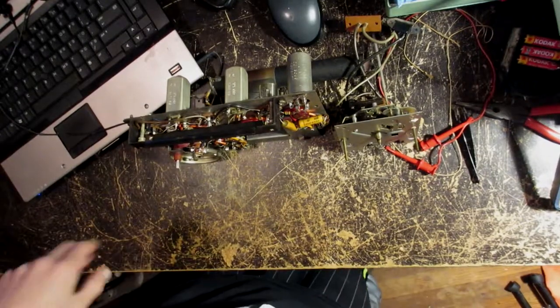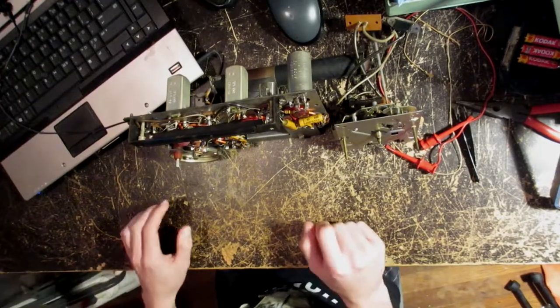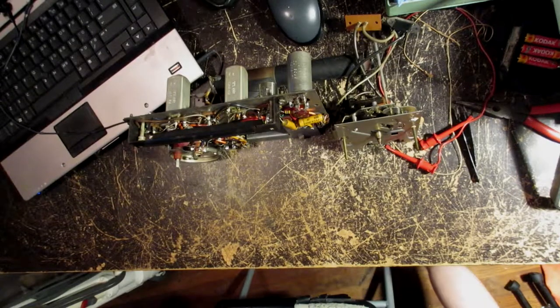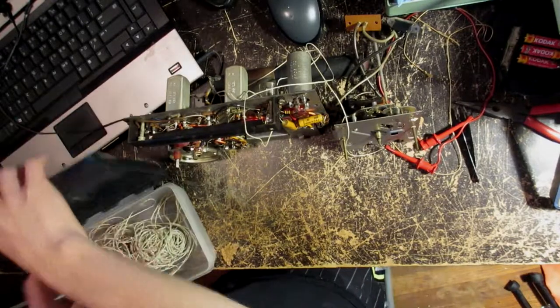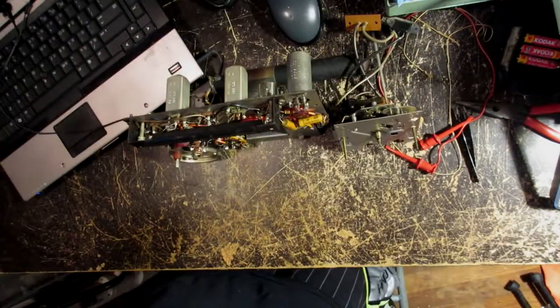Now, we are going to work on restringing the dial cord, because that's what it needs. Now, I have string salvaged off of a fishing pole, but it's still the same thing. Yeah, that'll do. Dial string? Probably gonna be doing three turns of this until I get it right, but still...